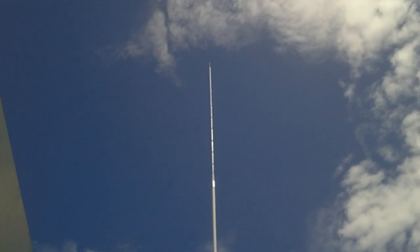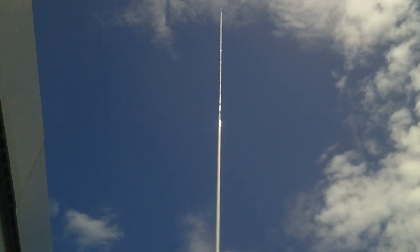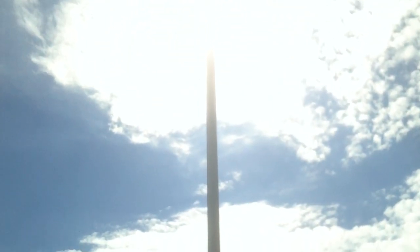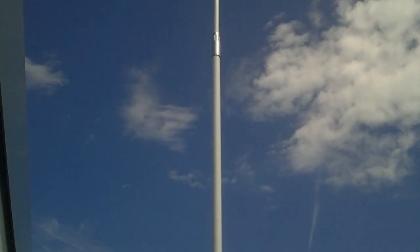It tips out at 28.555 with 1.8 SWR at the top end, and channel 19 at 27.781 MHz is flat. As for the name of the antenna, I'm not sure — maybe it will be the Skip Master 2011. That's down to Paul and Terry, of course, not me.